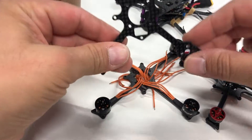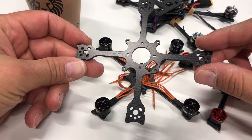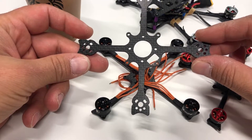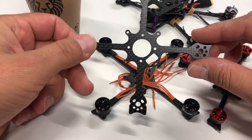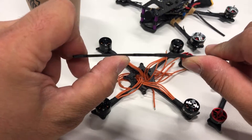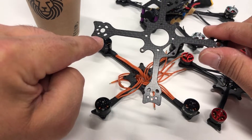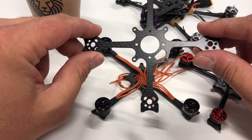You know the old design probably already — it's quite commonly used and pretty good so far. But I wanted to change a bit and simplify the frame and the designs. The old one is usually cut in two millimeters carbon fiber. It's quite stiff and flyable, with a universal motor mount for 9mm motors and a cutout for the USB. The frame usually weighs 5.56 grams.